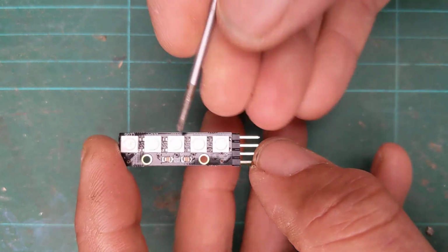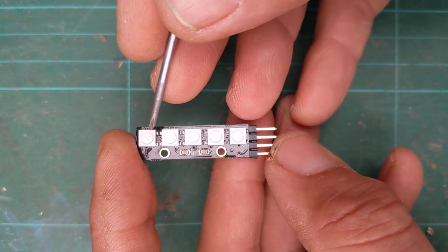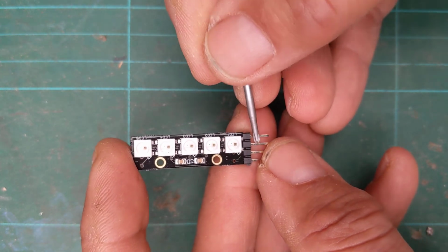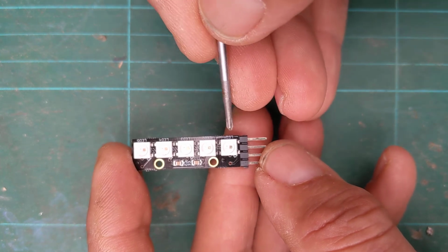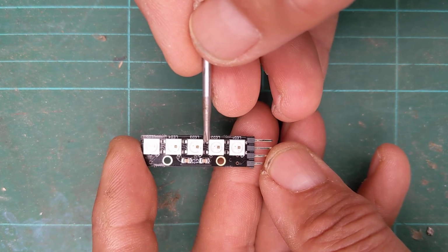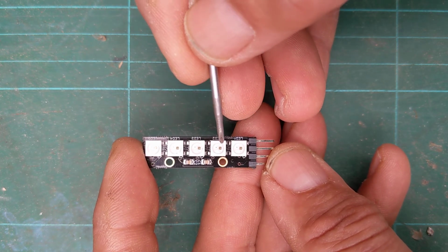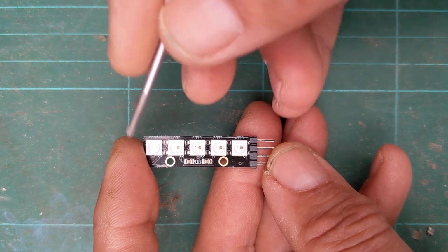But RGB LEDs, you can make them make any single colour you want. You can also control them individually. So if I had this one connected, say for example, to a temperature sensor, and I wrote a microbit program, I could make myself a visual thermometer, and the colours of these would change as the input went up or down. So that'd be quite a nice thing to do.